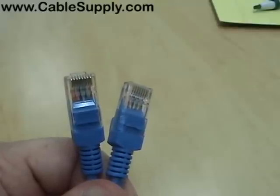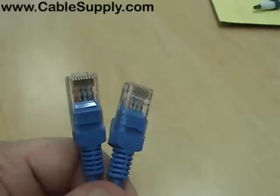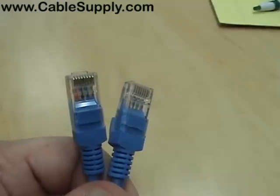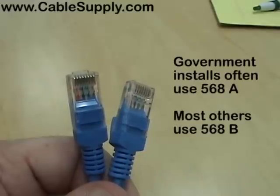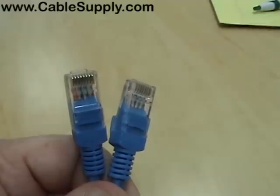You can cable either A or B as your standard when cabling buildings. When you're pulling wire down the wall and terminating it on a jack, you terminate it either 568A or 568B. By custom, most people use 568B, but it doesn't matter — A or B will work, as long as both ends, the jack in the wall and the patch panel in your data room, are the same standard. That's called straight-through.